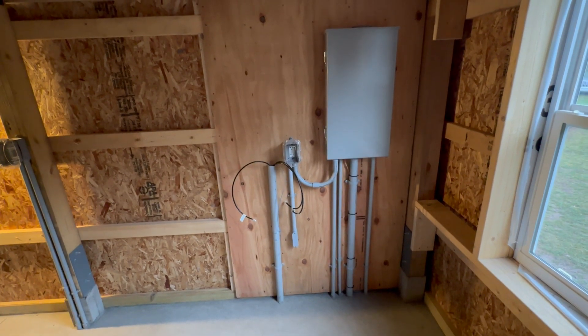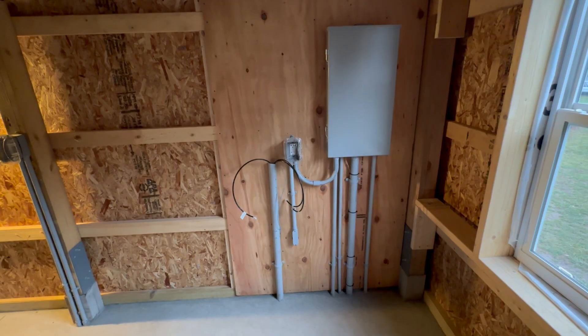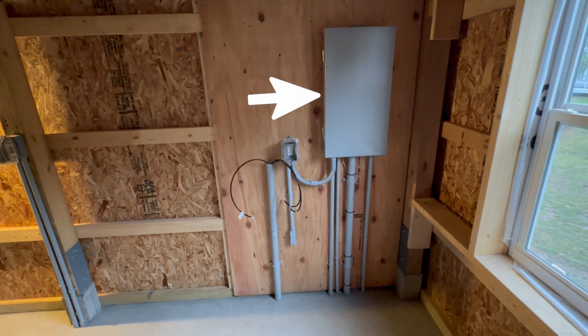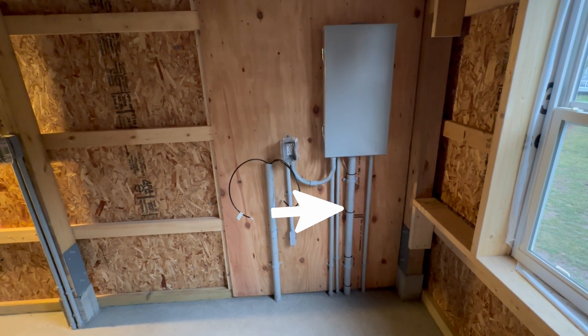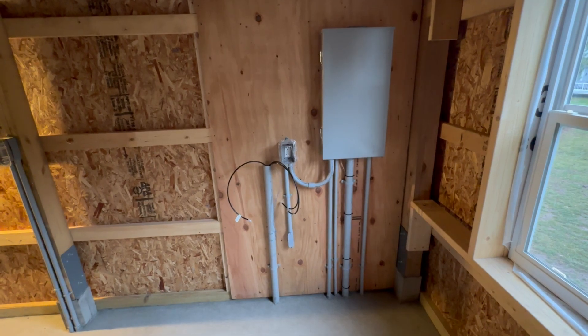This is a quick video under uncertain lighting — it's a dark, dreary day — showing how the electrical installation in the observatory went. We're looking at the main panel, which is a waterproof panel. The thick conduit coming up to it is the feed lines, and the smaller conduits coming down are distributing power under the slab to the various outlets and circuits throughout the observatory.